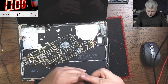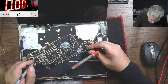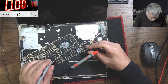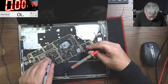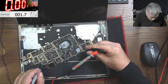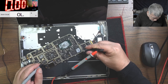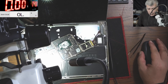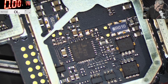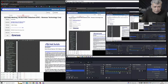We know that we have two MOSFETs. After the second MOSFET, where is it going? Because it's not the main power rail there. It has to go somewhere. It's coming here — to this chip. So if you have this board, have in mind this chip is managing the input MOSFETs. And now we are focusing on this chip. We found the datasheet of this chip.